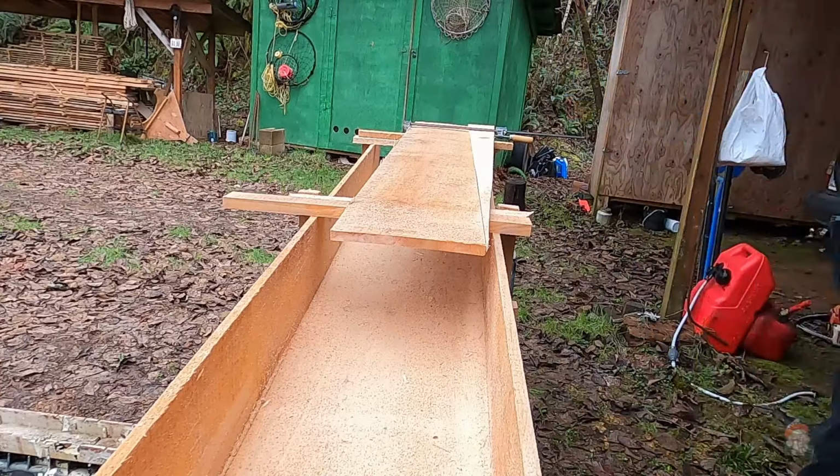I don't need walls this high. It'd be a waste of wood. Cut them in 1/2, and it's not high enough, I'm afraid. But I have other boards, not this wide, but wide enough for walls. So I will rip this in 1/2, right down the middle. End up with 2 11/16 pieces for the bottoms. And I'll go make the walls out of some narrower stock.